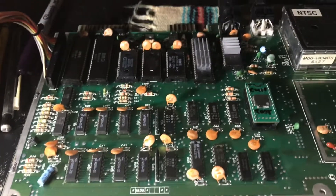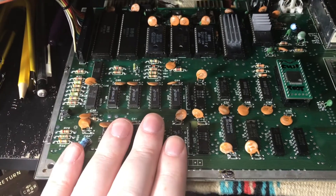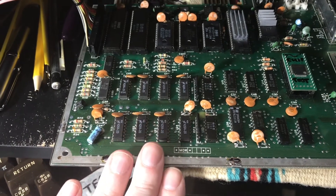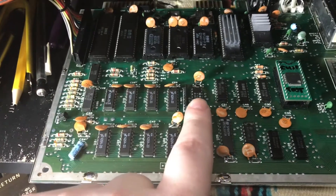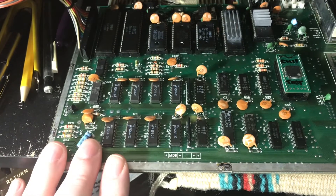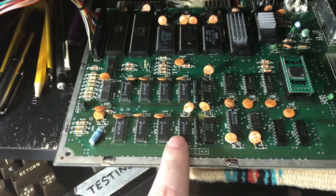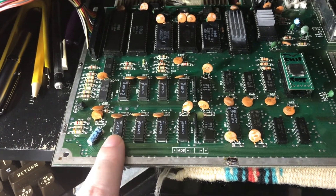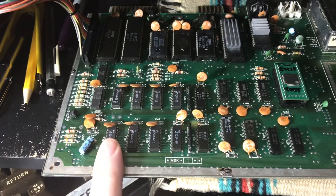The thing to note with this board is that I have populated it with the worst possible chips. These chips are absolutely notorious amongst people who know a lot about repairing Commodore 64s. There's a full complement of the small MOS logic chips, which are absolutely notorious for failing. This board also has a full complement of MT — which stands for Micron Technology — 4164 DRAM chips, and these chips are notorious for just falling over and dying for no apparent reason.